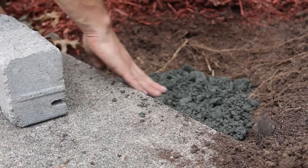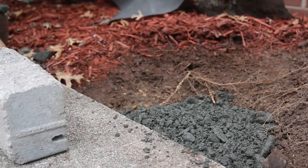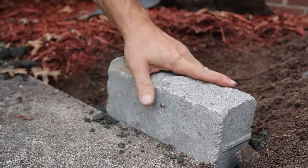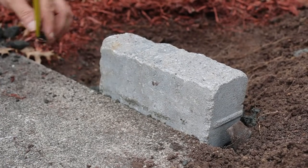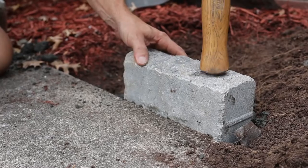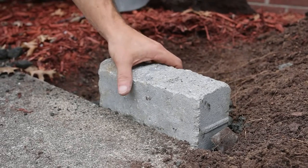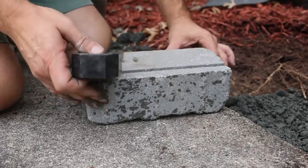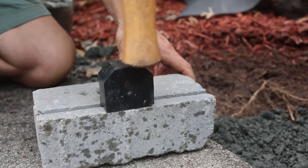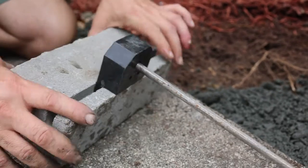I keep adding paver base until I get the desired reveal of my edging stones. I'm going back about six inches on my base for further stability and I don't have to overly compact this since it's just edging, but I do want a really strong foundation. I'm at about an inch down and I like to snug it with a wooden hammer or rubber mallet. The way this system works — it has that nice reveal that Techo-Bloc cuts in — you take the provided tabs, pop that in, and now we have the ability to stabilize each paver with a nice 10-inch spike.